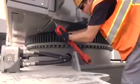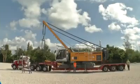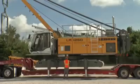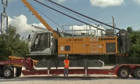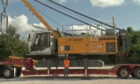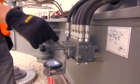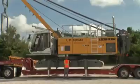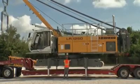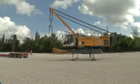Then loosen the tie-downs of the upper carriage. The next step is to raise the crane with the help of the jack-up cylinders. Sometimes extra blocking or matting underneath the outrigger pads is needed to achieve the necessary jack-up height. The alignment of the upper carriage can be checked using the level gauge located on the undercarriage right by the control levers. During this process, ensure that the cylinders are equally extended. When the crane is raised enough, the 9-axle can drive away.